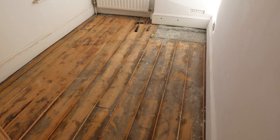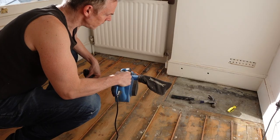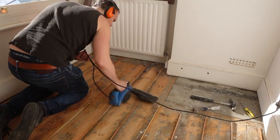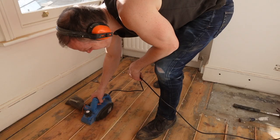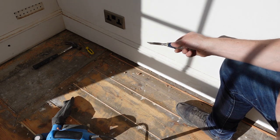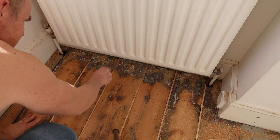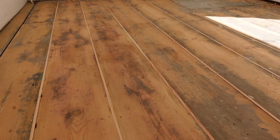I've left it overnight and it looks quite good already. Now I'm just going to plane these slivers down. I'm using a plane but you could saw them off or use a chisel. I'm using my chisel just to get the bits down near the wall, and then I'll be able to get my sander in there. Great, they're all planed down now.